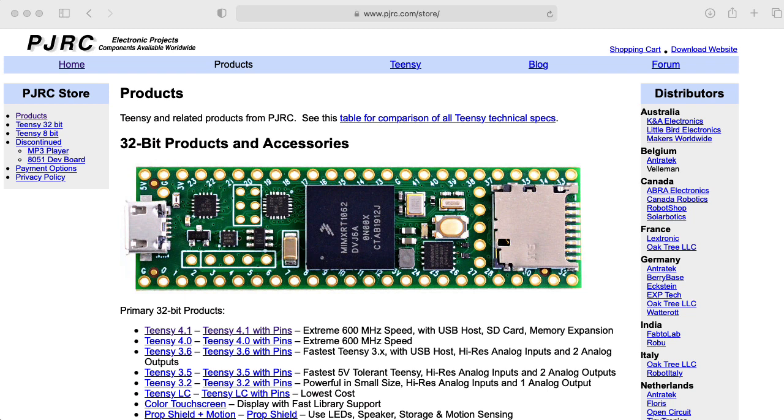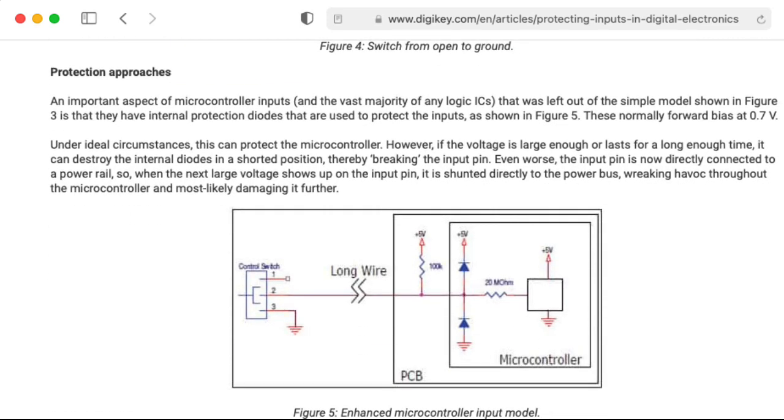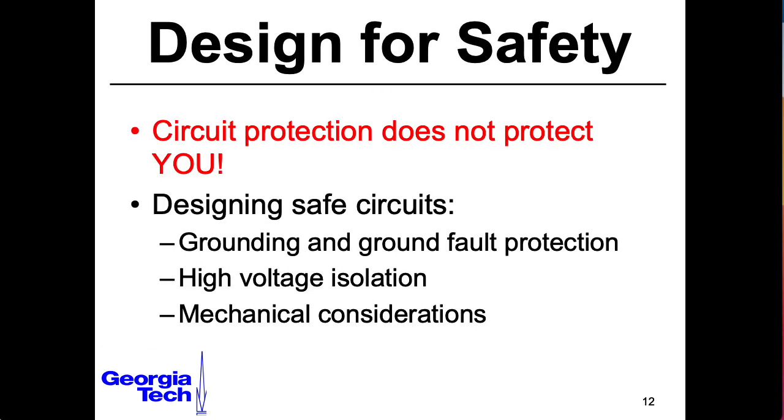The second regime is when too many volts are put into a signal input of a fragile device like a microcontroller. In those cases, input protection using various combinations of diodes is reasonable — I'd highly recommend a DigiKey article on this, linked in the description. The third regime lies outside human error and into nature: for lightning strikes you'll need spark gaps, and there are other technologies like gas discharge tubes and metal oxide varistors for handling power spikes from wall current. All of this protects the circuit, which is part of protecting you, but not the whole story — we'll cover more next time with grounding and isolation.